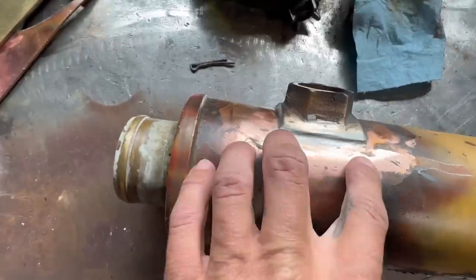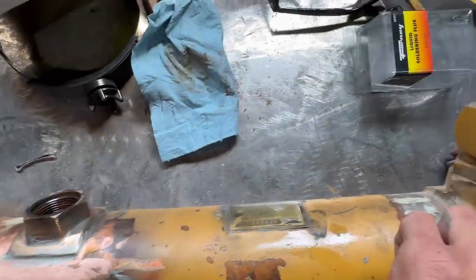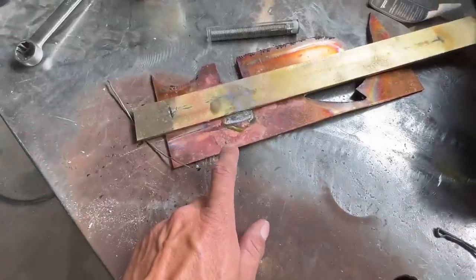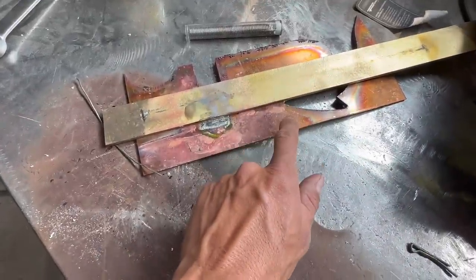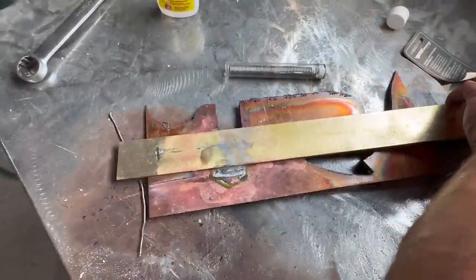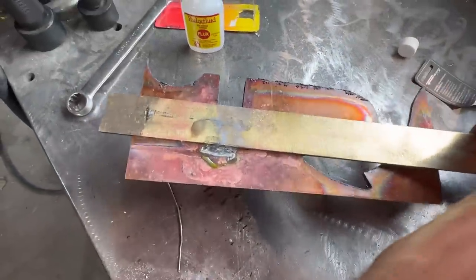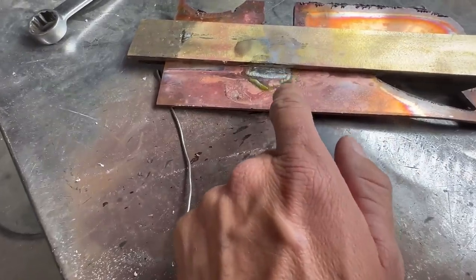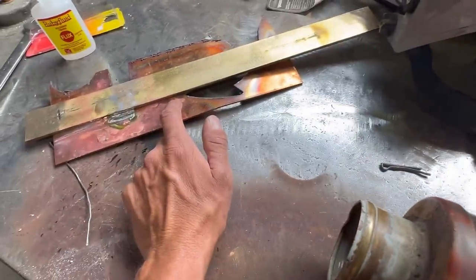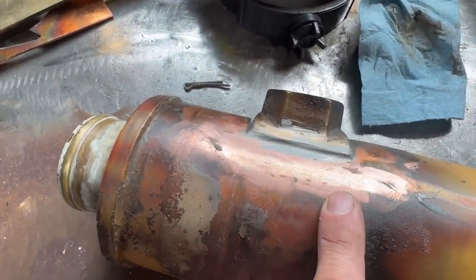So basically, how this works is hydraulic fluid goes in here, comes out here, and coolant goes in here and out here. We've already done a quick test piece because I carry some bronze and some copper in the truck with me, and I've gone ahead and brazed them together successfully as you can see. But from what I understand, this is just a little too warm, so I'm going to cool it down and then do another test before we work our way over to the actual part.